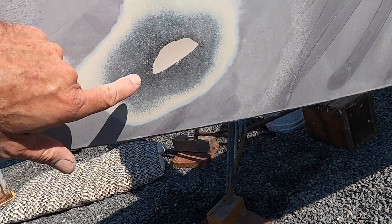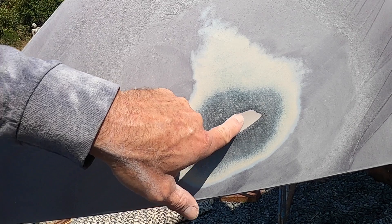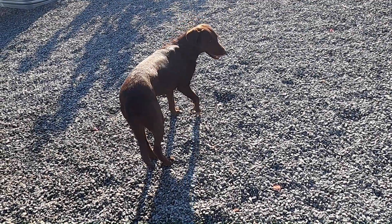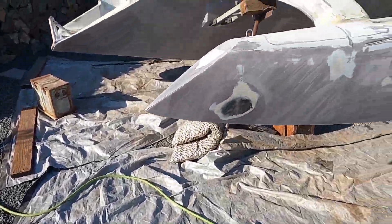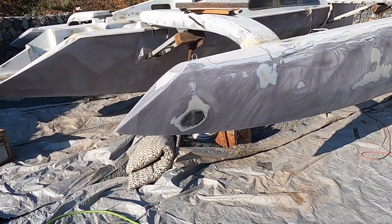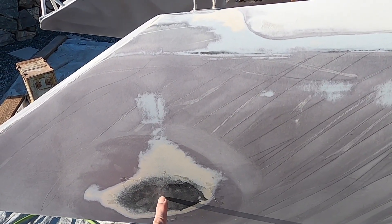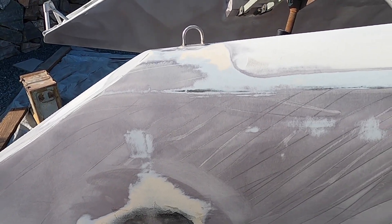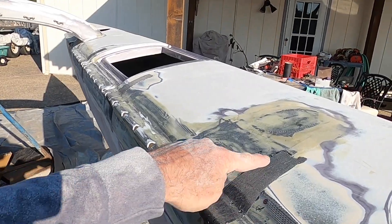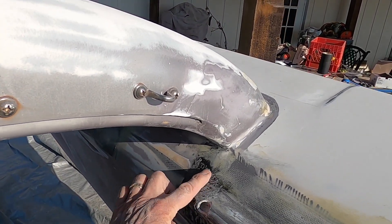During sanding we found a bit of damage - you can see the carbon fiber has been cut. I used filler in here, but as my finger goes down there's a big dent, so we're going to build this up with fresh carbon and barrel this in. That's a 2-day setback. We've done a 2-layer carbon patch - first I laid in a bit of Cabosil-thickened epoxy as the filling medium underneath two pieces of carbon. This is cured now after a few hours, so I'll put some fairing compound over this. I also added little caps yesterday for one more layer of strength - those need fairing too.